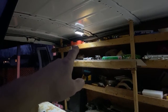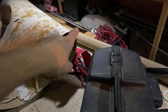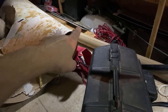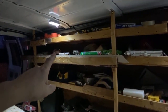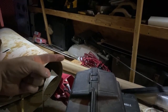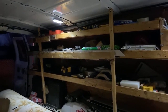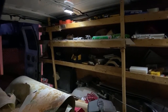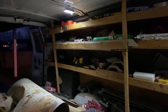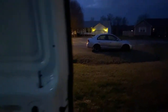To move the refrigerator, I have four spare vinyl plank click-together planks. I take the refrigerator in with straps, set it down on those planks, roll it back in its hole, lean it over and pull one plank out, lean it the other way and pull the other plank out — and the refrigerator never has to touch the vinyl floor until it's exactly where it belongs. Whenever I move the refrigerator back I'll video that and show how I move appliances on vinyl floor.